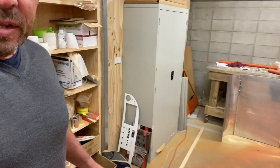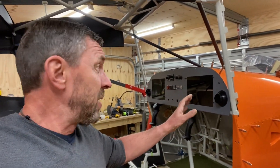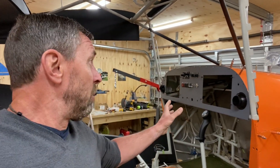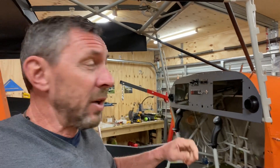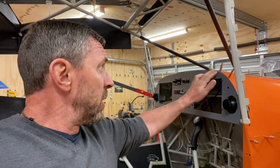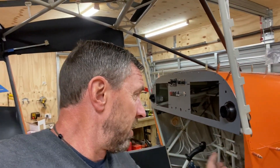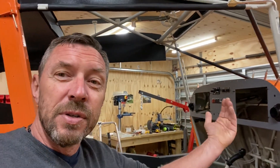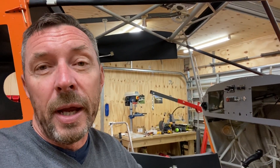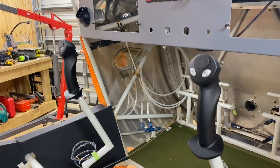Around the seven-month mark I had just finished mocking up the instrument panel. We printed off a file and took it to a place in the industrial area of Christchurch where they cut it out of aluminum using a waterjet — it's come out very well. I've removed the Dynon screens so they don't get scratched, but the panel is now mounted permanently in place. It's actually hinged at the bottom so when I undo these screws it folds forward — I'll probably only use that facility to pivot it forward while we do the wiring in the back.